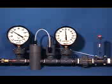The PRA pressure regulator can also be used without the PRS combination product. In that case it is controlled directly by a self-relieving type air regulator. Although it will permit remote control of the set point, the performance would not be as effective as it would with the PRS Stabilizer.